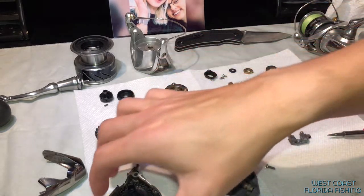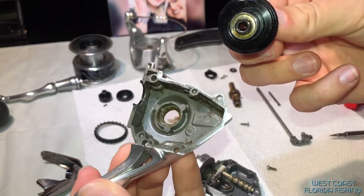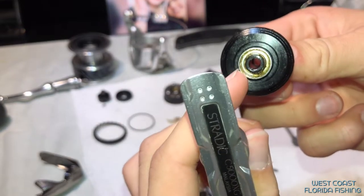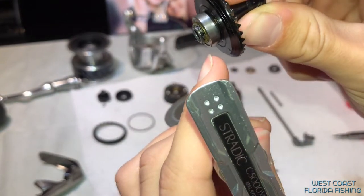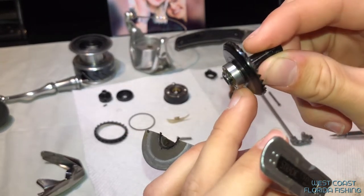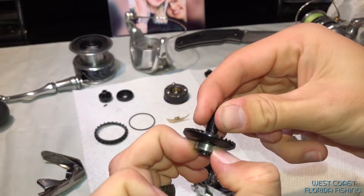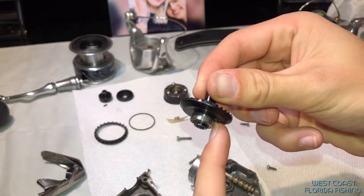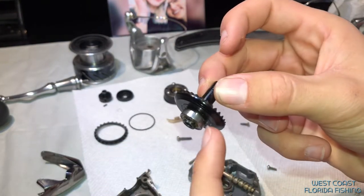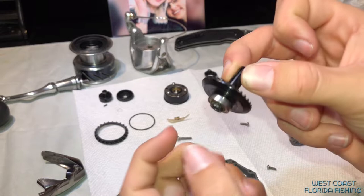All right, the next thing we're going to do is take the main gear out of the body. That should just pop right off. You can see that there is a little bit of corrosion and rusting going on with this bearing, so this bearing is probably going to need to be replaced as well. Underneath this bearing, there's actually a whole bunch of shims. And one of my subscribers commented on my other video and asked how to reduce handle play in the brand new FL. How you do that is when you take off this bearing right here, you increase the amount of shims. They're very, very thin, literally like tenths of a millimeter. And you just keep adding them behind this bearing to this main gear till you don't feel that handle play.